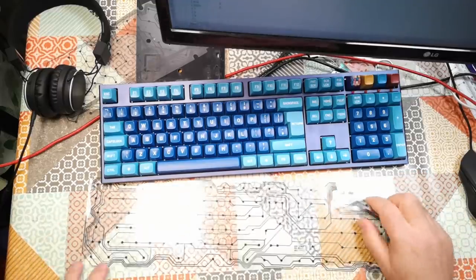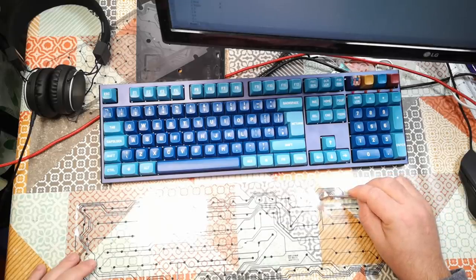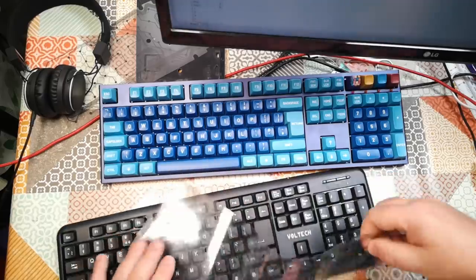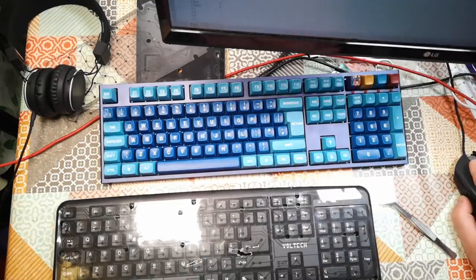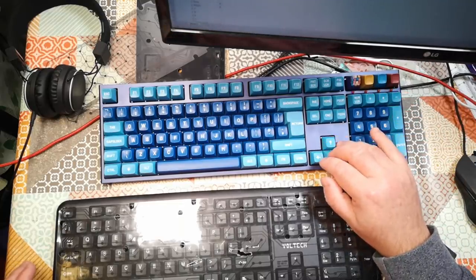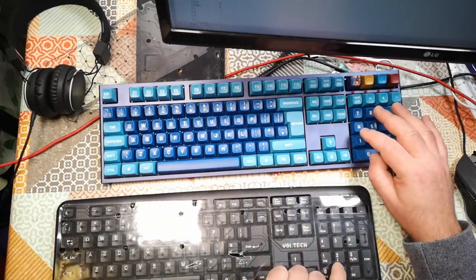This keyboard doesn't have those safeguards, and so what they appear to have done here is wired the rows and columns in such a way that the keys that you're likely to press in combination, like Shift or Control and Alt, aren't on any of the same rows or columns. It's still only got what they call two-key rollover. It's just a little bit less likely that you're going to collide with the inherent two-key rollover of this simple keyboard matrix, just because they've separated some of the keys that you will press in combination. But I think we've probably sidetracked a little bit too far there.